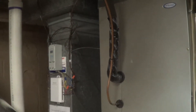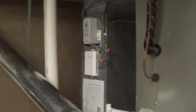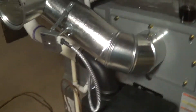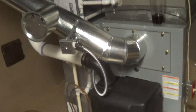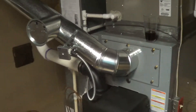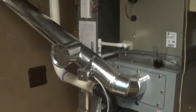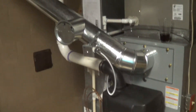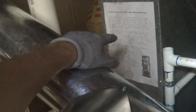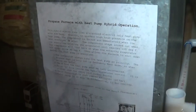Also, if the heat pump were to not run for some reason — like totally iced up outside or buried in snow — it's going to automatically turn on the oil because of second stage heating. On the thermostat it shows auxiliary heat, and the customers know when they start using a lot of auxiliary heat their bill's going to go up. The link in the description shows the setup for the hybrid. It's very simple — just put the little peanut relay inside the thermostat.